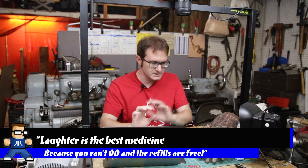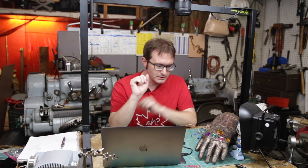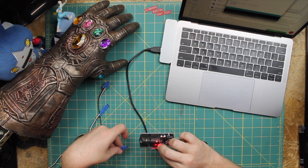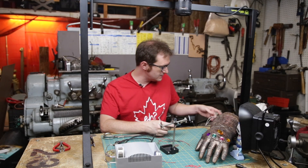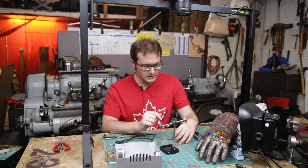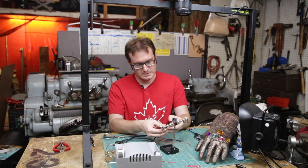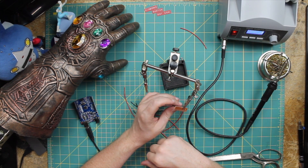So we know what each one is now. We need to write a little code and get our lights blinking the way we want them to. Since they're ganged up, how many grounds do we have? We got one, two, three grounds. I need four. So I actually need to solder — I've got to do a little bit of ganging here. I need four grounds and I only have three on the Arduino. So I'm going to have to do a little combining using this little scrap of proto board, put three of these together with a fourth going out, and call it a day.